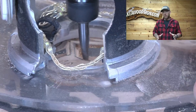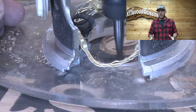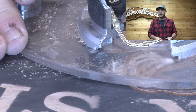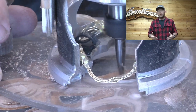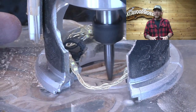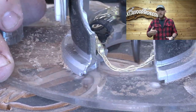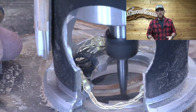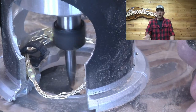I messed up recording and didn't get the carving liner on this video, but we used the carving liner for the really fine detail in the spoon and the spatula to get those nice sharp fine lines. Then we went around everything else with the profile bit — the depth is right at about three-sixteenths to an eighth. Once we had our full profile done, we went deeper with the profile to give it a nice bold line, then did a little cleanup with the 90-degree bit at about a quarter of an inch to take all the black out.